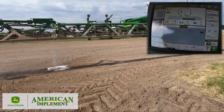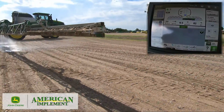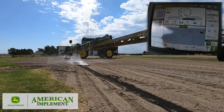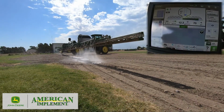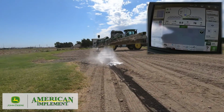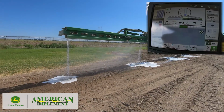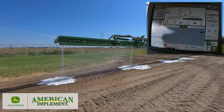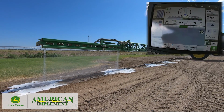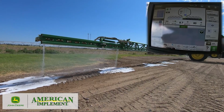When you open these up, the ends, it does not take long to get all the product out that you need. Now, anything that's trapped in the boom, it will come out of the boom. So I still have plenty of product left in the boom. So I'm just going to go ahead and turn all my sections on and finish flushing out the rest of the machine.